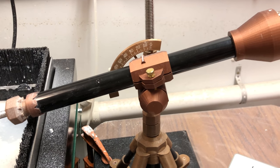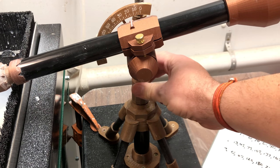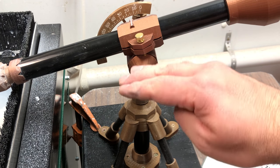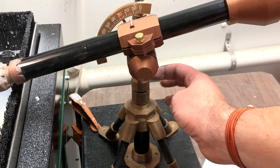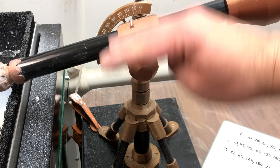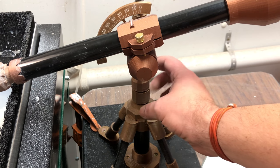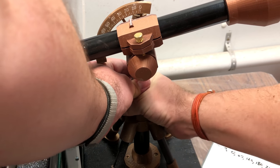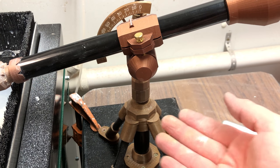Looking underneath the facet arm, you've got two screws here. The top one you use to adjust the height of your face angle by shifting the Lap Dancer up and down on its shaft. The second one is the lock nut — that's going to lock this in place because as you're grinding, you don't want your facet arm to shift up and down at all; you want it to stay exactly where it is. So once I've set my level, which I'm happy with, I'm going to take this set screw and tighten that down against my height adjustment so this does not shift up and down at all while I'm grinding.